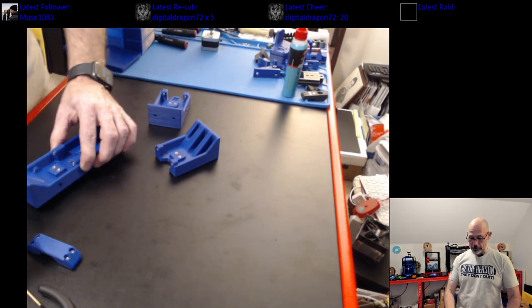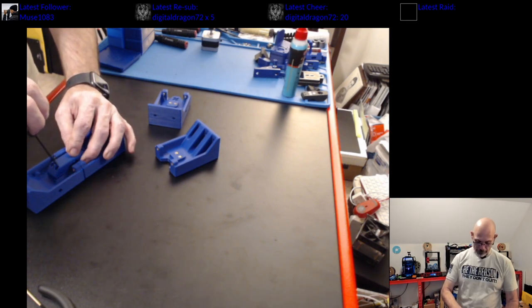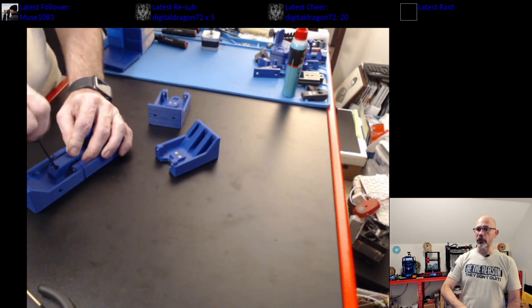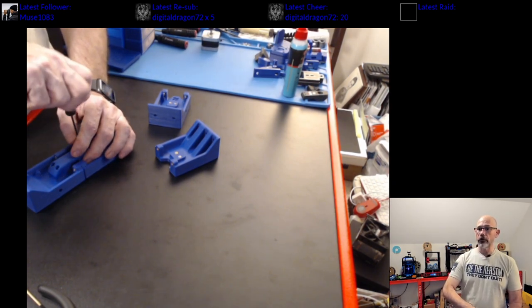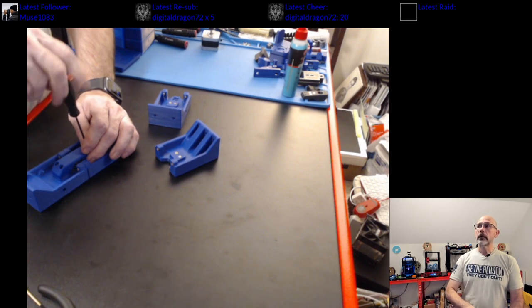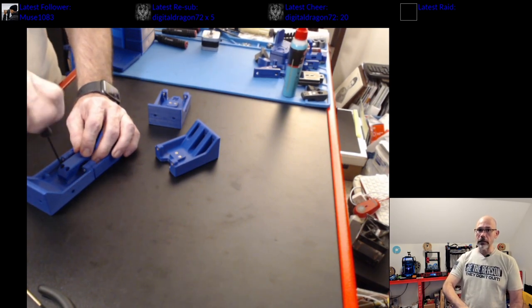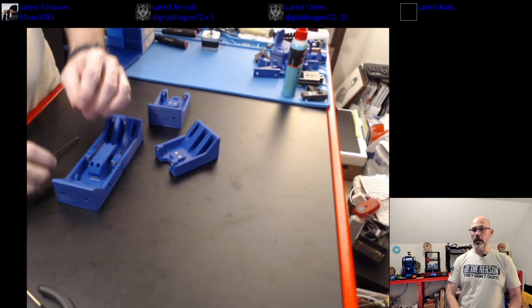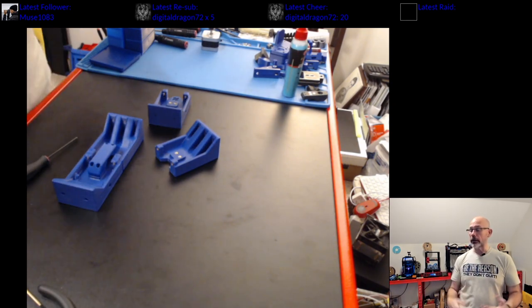And I recently had a crazy, crazy print failure. It was so bad, it ejected the print bed out the front of the printer. This is on an overnight print that, you know, I printed all day long, no problems. Do an overnight print and it spits the build plate out the front of the printer. And at that time, it chewed up the gantry, because in the process, when it flung it out, it loosened up the entire linear rail for the X-axis. And so it was flopping around and it gouged